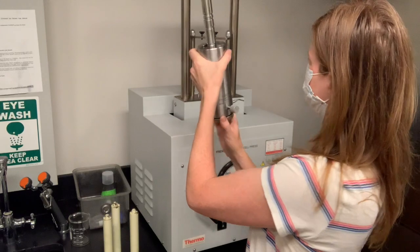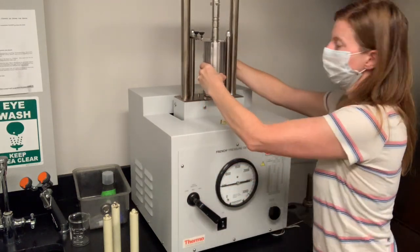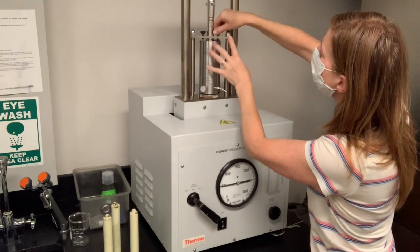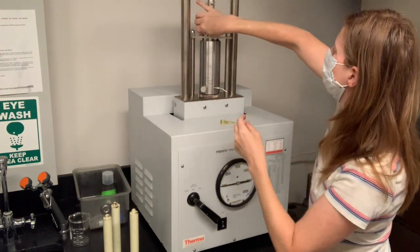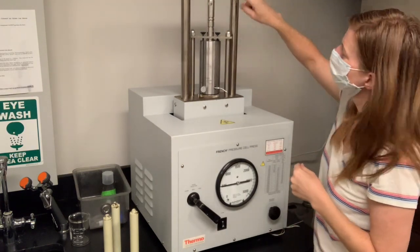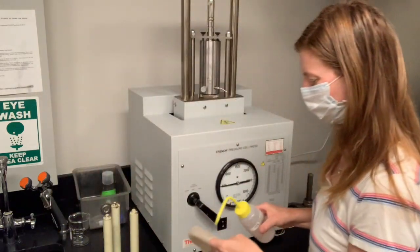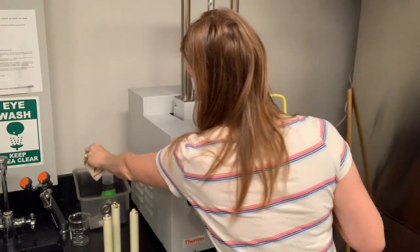Grab hold of the cell firmly, keep your hand on the bottom as much as you can, and place the assembled cell onto the platen. Push it back so it's flush against those three steel pegs. Then rotate the safety bar into place and screw down the black thumb screws. Move the metal bar out of the notch on top of the cell that was holding it in place while it was upside down. Finally, rotate the piston handle so it's perpendicular to the screws at the very top of the machine — they must be perpendicular or it will damage the handles. If the valve isn't quite sealed and a little bit squirts out of the outlet tube, clean up with bleach or ethanol.